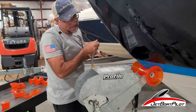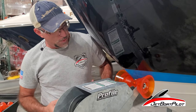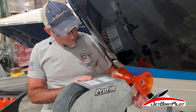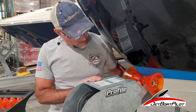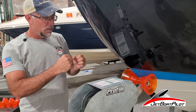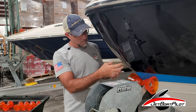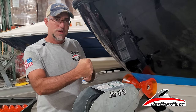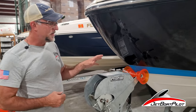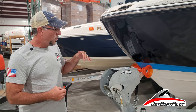Also tighten it enough to where you don't have any side-to-side motion. I'll lift up on the boat with my shoulder — see how we're able to rotate. We want freedom of rotation, we want all three pieces to rotate without any binding. As long as you have that ability for it to roll and the nut and bolt don't have a lot of lateral motion, you've got a good install. That's the prescribed installation procedure to put your Stoltz roller on.